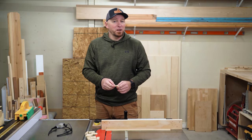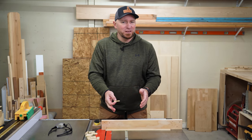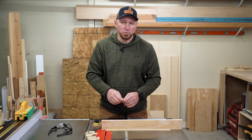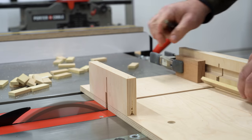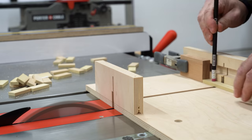You can use or even modify a regular crosscut sled as well, but if you think about it, it's really no different than using a miter gauge with an extended fence when it comes to actually clearing those parts away from the blade. As long as you clear each offcut between cuts, you should be just fine — but this can be time consuming if you have a lot of pieces to cut.